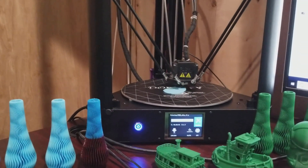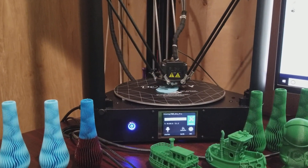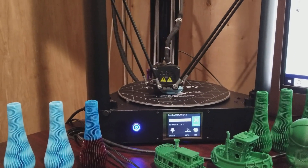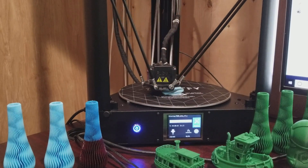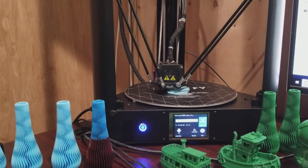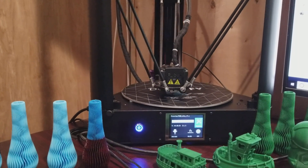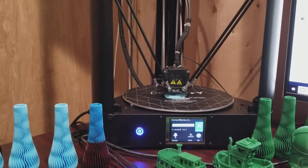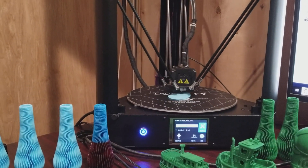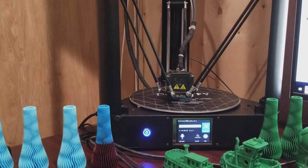Let's talk about the printer a little bit. It's built really well. It's got a MOSFET for the hotbed, which was surprising — you don't see that too often stock. All the parts are MakerBase; that's the brand of everything. The TFT is MakerBase. The MOSFET is MakerBase. There's a little IO add-in board in there that's MakerBase. The motherboard is a MakerBase MKS Gen L with removable steppers. The steppers are A4988s. There's a pretty nice 40mm by 20mm fan inside for cooling. It's fairly quiet.